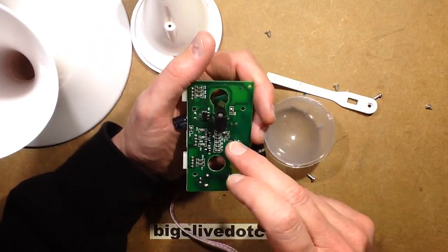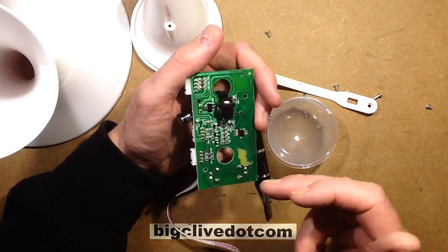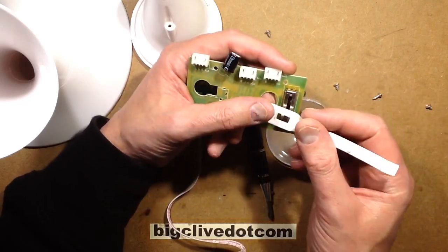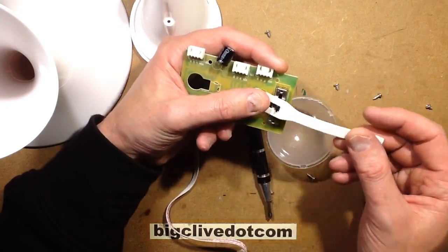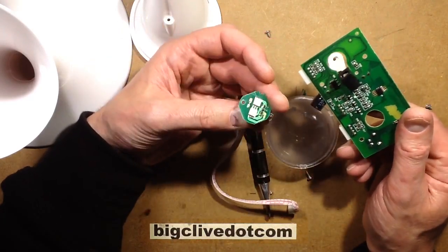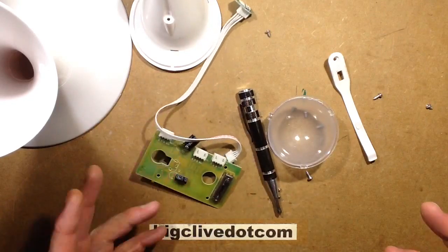So that's really it: the classic little 8-pin microcontroller, a little 5-volt regulator, three transistors for driving the LEDs, and the potentiometer with that quite nice arm that hooks over it and slides it as you move the arm — quite a nice mechanism, I like that detail. Not a huge amount to it — it's very straightforward. Now I'll show you what these balls look like when they're glowing.